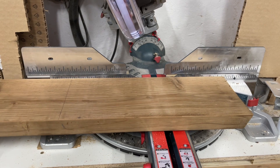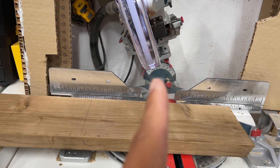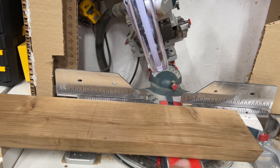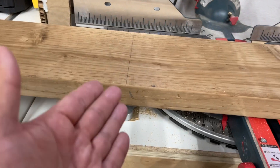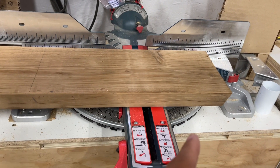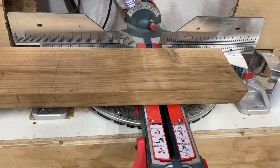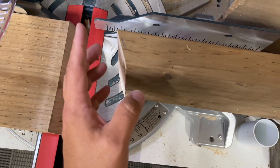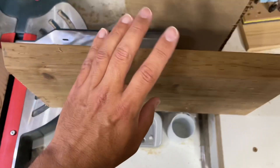One other thing to remember - we're not going to change the bevel on the blade because it's a nice 22 and a half degree angle. We are going to want to flip the board over and back, over and back as we do the cuts, so that we have the angle here and the angle here, both angled into the same spot to give us a nice octagon. If we just keep one after the other it's going to be a straight board we'd screw together. This is why I love shadow lines more than anything else these days - it tells me exactly where that blade is going to be. I can just nudge that board over until it's perfectly lined up with that shadow line and I know exactly where the blade's going to cut. We got one board out of eight cut - nice 22 and a half degree angle - it's perfect.